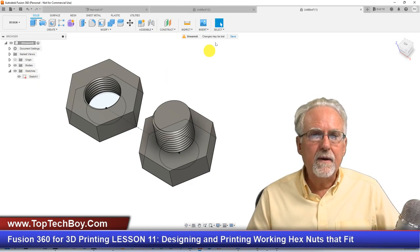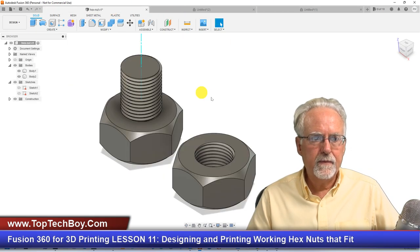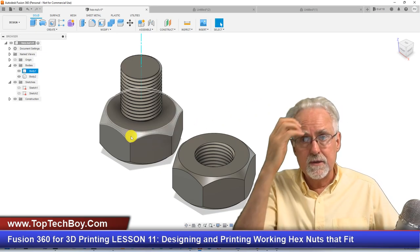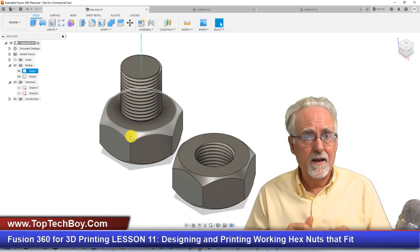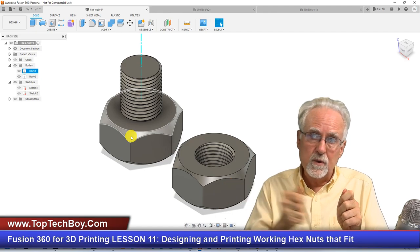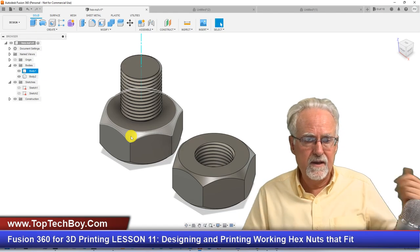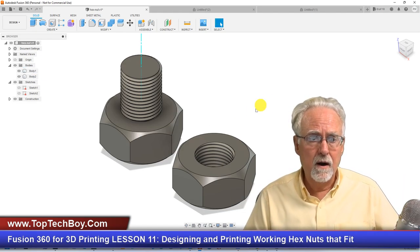But now, if you look at my solution though, that was not my solution. Did I do it? Yeah, there it is. What do you notice? These elegant rounded corners. Now, why do nuts and bolts have that little round on it, that little taper? The reason they have that is so a tight fitting wrench will seat itself. It gives it a little thing to start and then go on easily.